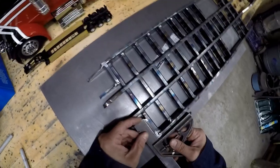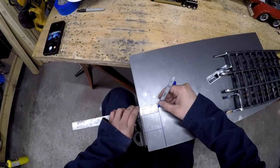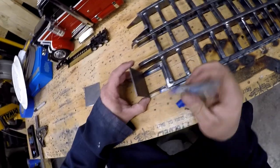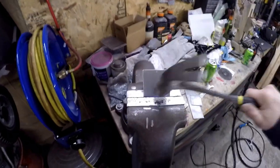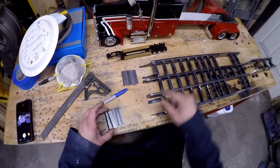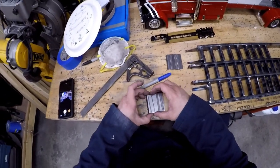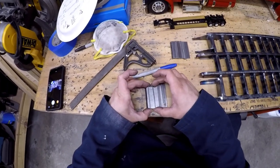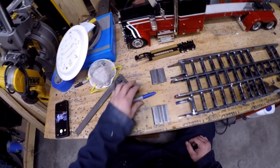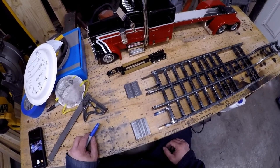I have to do some measuring, some cutting, some bending. Let's measure our width — I'll end up hanging it over a little bit so I can grind this edge down. Now I need a bend — pretty good right there. I cut these nice little strips that I used when I split this one inch apart; the strip that was down the middle. I still have a bunch left, which I'll save, and these I'm going to weld in here like this and then grind down their height.